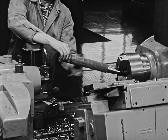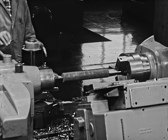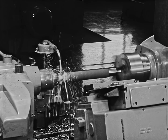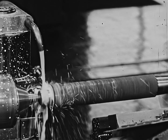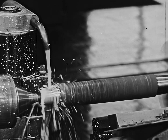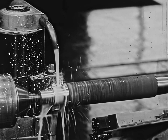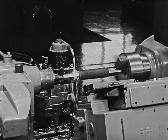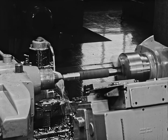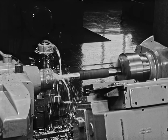The other end of the shaft requires only one rough cut followed by a finish pass. Total machining time for the rough cut and finish pass is just under three minutes. The big story in this job is the money the manufacturer saved by turning to the Model 21H monomatic. The cost of machining by former methods was in dollars per piece — now it's in pennies. Before, it required 804 minutes to machine 10 pieces at a cost of $8.70 each. Now he does it in just over 90 minutes at a cost of 97 cents each.